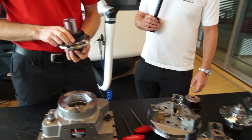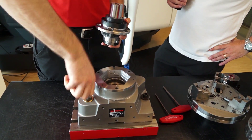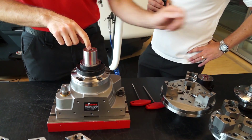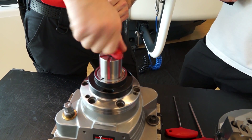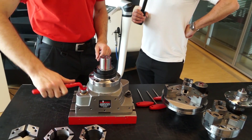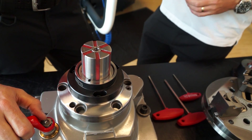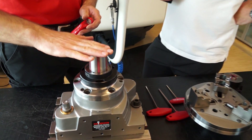This is a mandrel adaptation without a draw bolt. It's most often used for blind holes. I place it here — I have to check if this one is in release position. Then I lock the adaptation with three screws, and then I connect the coupling of the mandrel adaptation with the stationary chuck. I lock the coupling and when I actuate it, you see the bushing is moving and spreading open — in this case 50 millimeters.